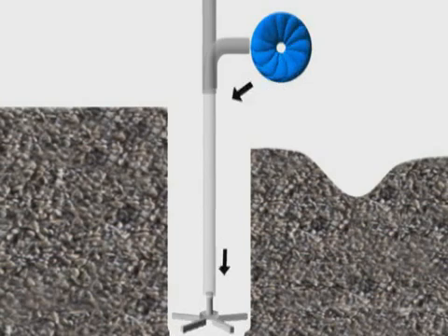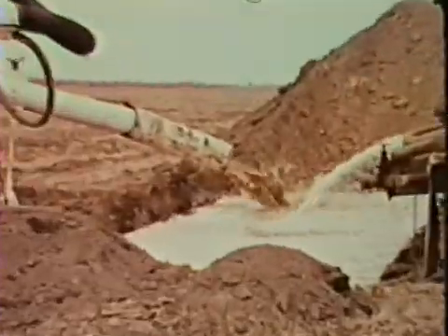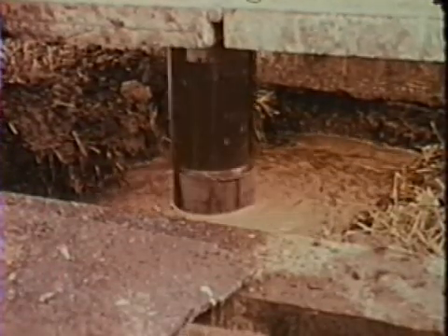This fluid is sent down the annular space between the drill string and the borehole, removing cuttings back up the drill string and into the settling pit. This pit must be very large to accommodate a sufficient amount of fluid, which is required to flush the large amount of cuttings generated in drilling a borehole of this diameter.